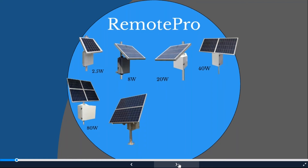From the 720-watt array upward, we include the pole mount. Everything else — solar panel, enclosure, battery bank, solar controller, cables, and mounting hardware — is included with the Remote Pro system. The 720-watt array uses two 360-watt panels, too large for a standard pole, so we provide a pole mount for a concrete pad. That system ranges from 400 to 720 amp-hours of battery bank.